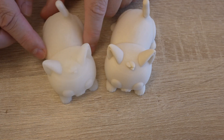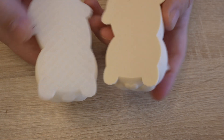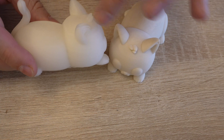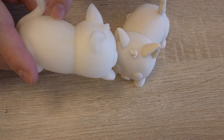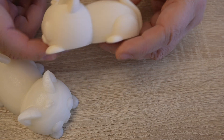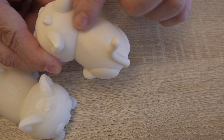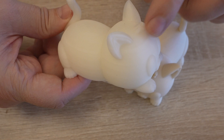About the transparency: the E-PLA is more transparent, and we can better see those layer lines there. This is the first time I used adaptive layer height, and I can see the transition — it is more visible on this one. But don't forget, this is partly transparent. Here it used a bigger layer height, and here it was smaller. On the Textura, those transitions are a little bit visible but much more hidden. This is a really nice surface — even on the top it is almost completely smooth. I believe the transition would be much more hidden with colored filament.